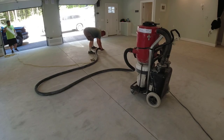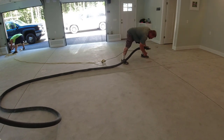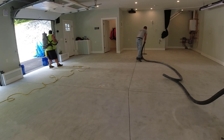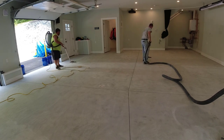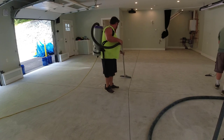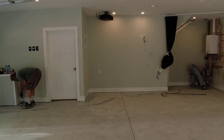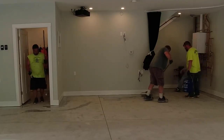If there are any tiny cracks, pop-outs, chips, or divots, we have a repair material that fills them in — that's pretty easy to use and I go over that later. Basically we start each job by getting the grinders out and grinding the floor. The grinders not only prep it for the coating but they clean it too — removing any debris, oil, dirt, dust, and anything ground into the floor over the last 10-15 years. Then we vacuum it a couple of times to get all the dust off.